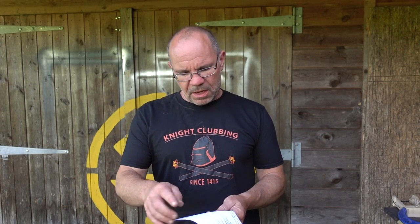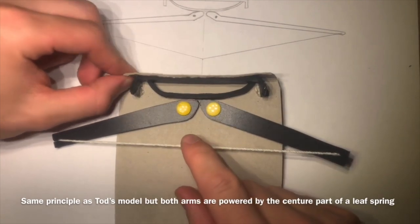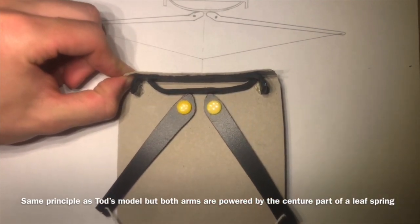The first theme was basically reworkings of my idea. My original idea — had I just stood there and stretched out my arm with two kilos on the end and thought 'can that work for me,' I would have saved myself six hours. Good lesson in design. Fiop Kassa effectively takes my design and does the pickup on the lever arms into the middle of the spring, not onto the outside, so the spring is not balanced on a knife edge — you get a much more reliable draw. That's a great reinterpretation, but I suspect the weight would be too much and make the whole thing pointless. Great stuff, Fiop Kassa, but didn't crack it.